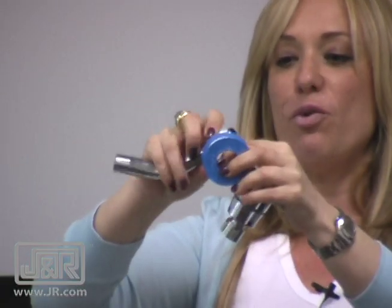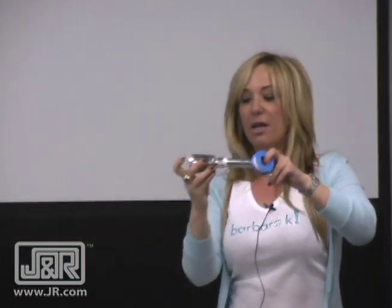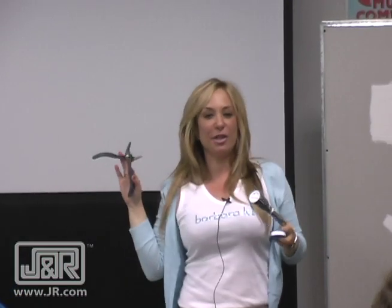So when you replace a new shower head, you put the sealant tape around the stem, and then you take the new shower head and you twist it on, okay? And then you take your pliers and your wrench, and I like to use a rag, I don't have one here today, but you always turn to the right. In plumbing, it's always left loose, right tight.